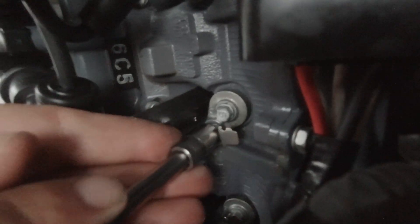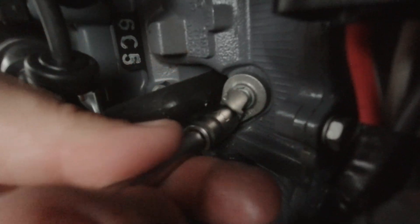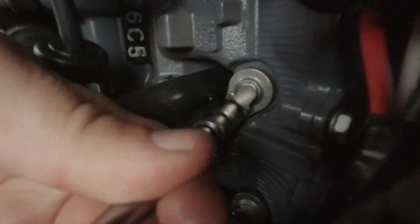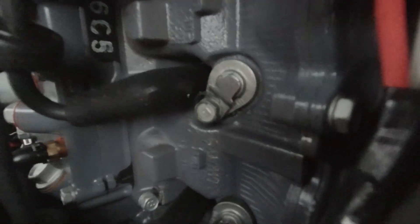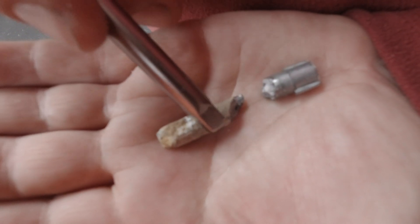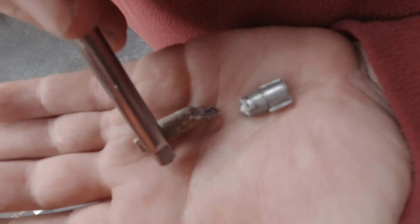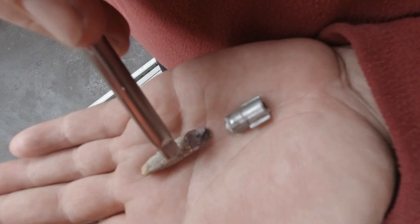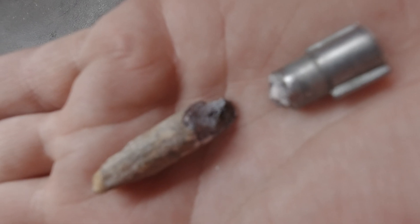Get your bolts and your 10 millimeter socket, start doing it up — ensure that the little cover sits over the top there. Firm without being too firm — bob's your uncle, we're done. Interesting point to note: as always, the bottom anode is the most corroded. As I was getting it apart it fell apart — looked fine at this end, but there was a larger section missing and it just fell apart and went all crumbly. On the inside it's like it's turned into some sort of honeycomb, so good job that we replaced it now.